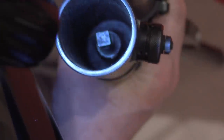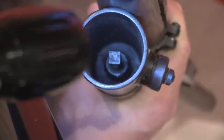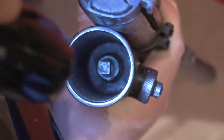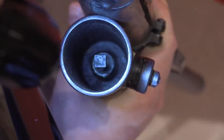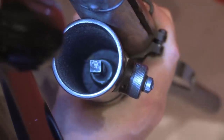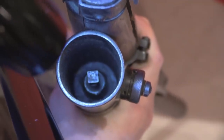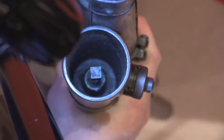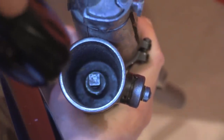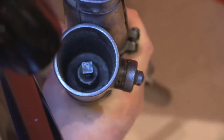Here's as best a view as I can get you down into the grenade cup launcher. You can see the square-ended stalk there, which is what the grenade actually sat on, and then there's a larger plug below it. That larger plug basically covers the contour of a 6.5 Carcano chamber and catches the bullet. That square end is square so that you can fit a wrench on it and unscrew it in the case of a stuck projectile. We can't see the gas vent holes down in the bottom simply because of the angle — but that's what you've got for the launcher itself.